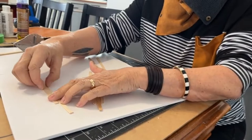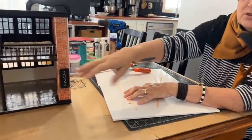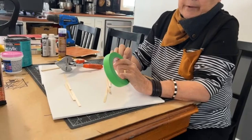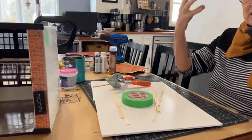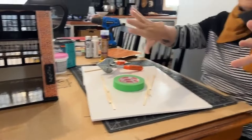But you have to do it very slowly because you have to do a couple pieces at a time and weight it. It depends on what your weighting system is like and how much room you have. Mind you, this wasn't in when I was doing it. I was doing it out on the counter. But you have to just do a few, weight it down. I use a lot of painter's tape as clamping. Where you would normally have a clamp, when I'm doing all these edges, the tape is everywhere, and that holds. I'll put ten across there, and it acts like a clamp and a weight, and it tightens everything up. So I use a lot of painter's tape when I'm doing the floors, and you just have to lay it until it's finished, and then it really warps. But when you do the other side, it'll flatten itself out.